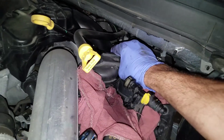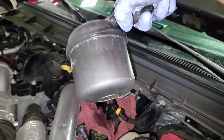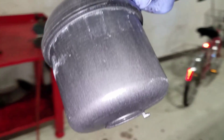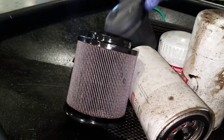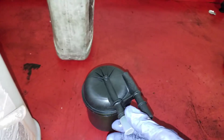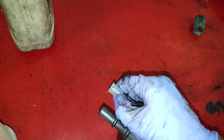The next step is we're going to turn the fuel filter counterclockwise until it stops — I can't go any more. Now we're going to wiggle it right out of there, just like that. You can see it's got a little foot on the bottom that indexes it into the cup that it sits in. There's the primary, and there's our secondary with the cap on it.